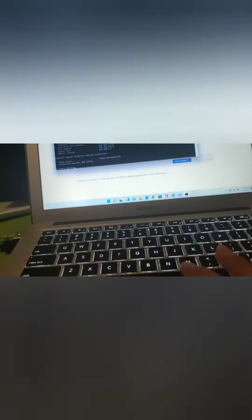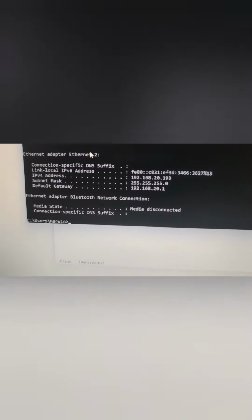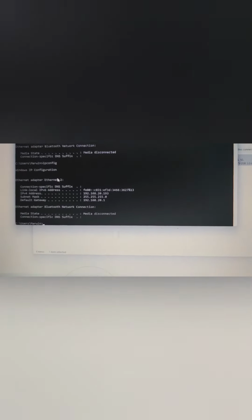Now I will change the port because we bridged the 1-2-3 LAN. So for example, I go to 1. Or 2, that's 1. There, 1. Now, look, it gets another IP directly from the router. See? My IP changed to the router's IP. So you can use this on PoE and you can do this. This is because I'm trying to expand my PoE and I don't have to use a switch. Now you can do it.